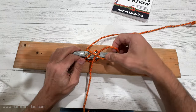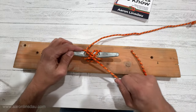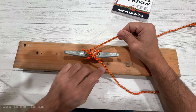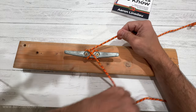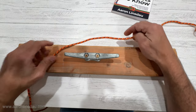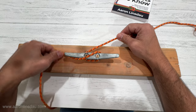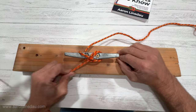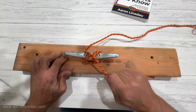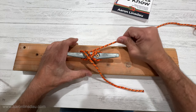So instead, what people do on really big boats is you just loop it once or twice, throw it down. That way, if something goes horribly wrong, there's no locking — you can loop and release, and the boat can get away. I cannot emphasize that enough. On a big boat, never put the lock on. Always just put a couple of loops over. The hawser will be heavy enough — no big deal — and it'll be safe.